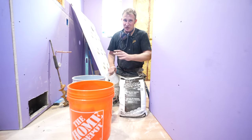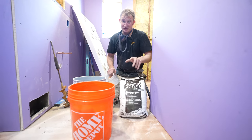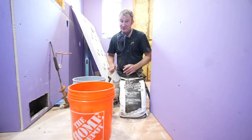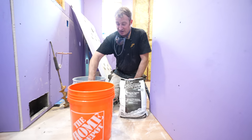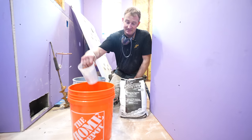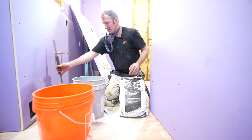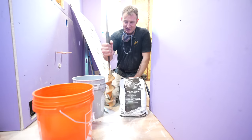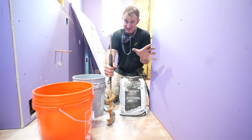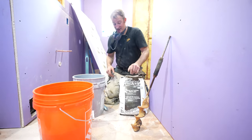If you just need support and have a completely level floor, make it pretty loose — pourable out of the bucket — so there's no fighting it holding anything up. But in this instance I'm trying to overcome some unlevelness, so I'm not concerned about it being a little thicker. I'll start with about four quarts of water for this bag — you'd probably use three and a half for a shower mix. One great tool is this mud mixer; it lets you mix at a drier consistency, which is really tough with a thin-set paddle. Highly recommend it.